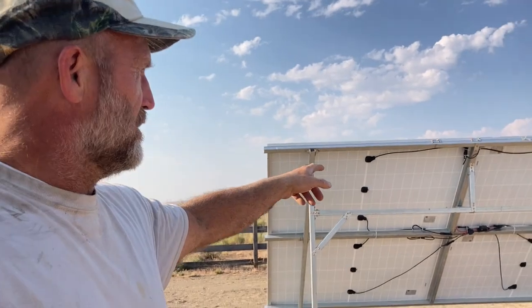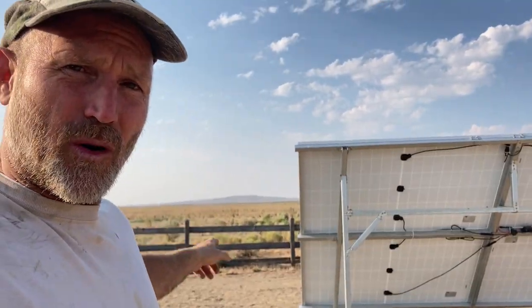It can handle it. There's actually a knob on the two-horse controller that allows me to adjust the power going to the pump, so I can modify it if I think it's too much. One thing I noticed that I'm concerned about — it's July now and I'm getting two-and-a-half GPM at about 220 feet of head — but I'm worried about the winter. So I think what I'm going to do is add two more panels on a switch. I don't want to put too much wattage on there in peak summer, but if I have a little toggle switch that in the wintertime I can hit, it'll bump up my overall wattage. At the winter solstice when the sun's at about 23 degrees over the horizon, that might give me enough water to get into my tank.